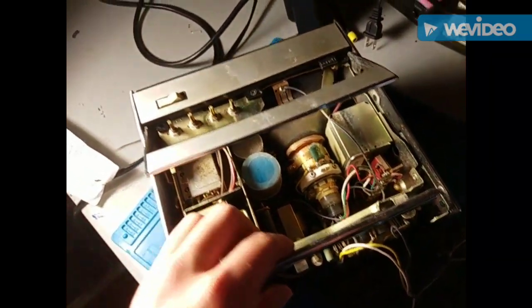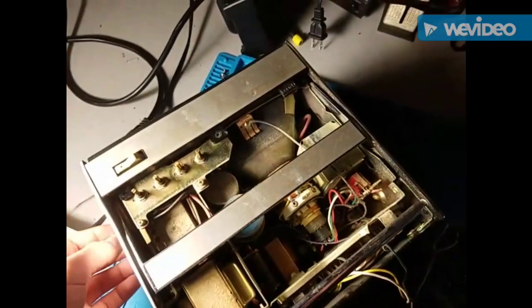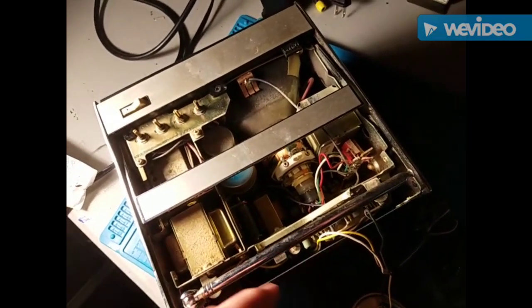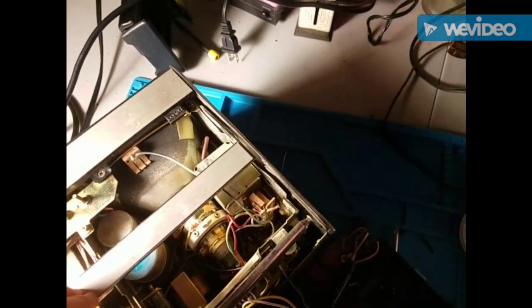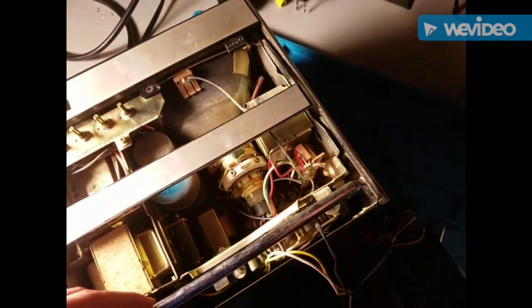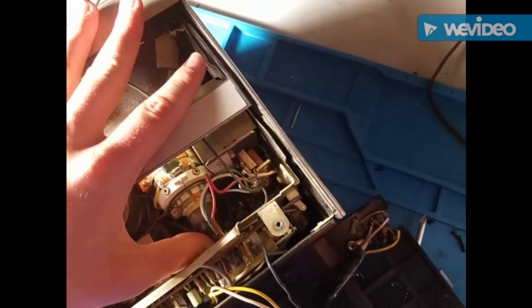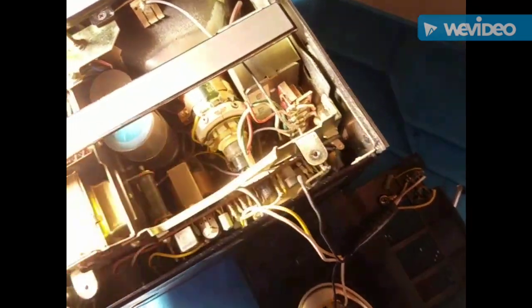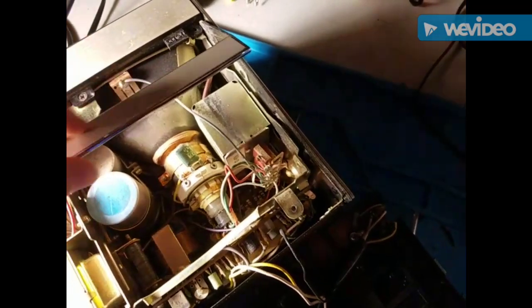What I'm expecting is there to be one vertical line going through the CRT, and that is a very common issue with these — with all Japanese black-and-whites of the '60s — just one vertical line going through the screen. So if you want to use one of these you have to recap it. That's quoting Shango 66, so that's my source on that one.